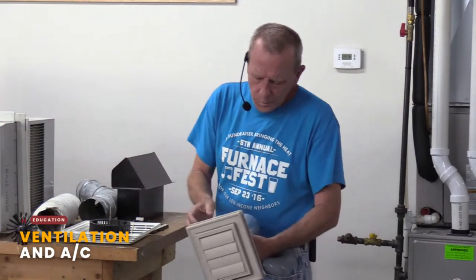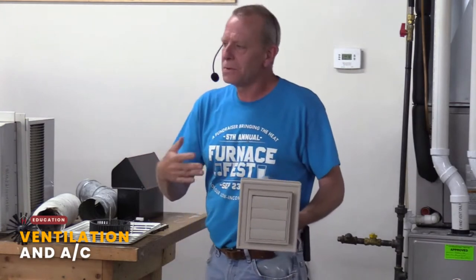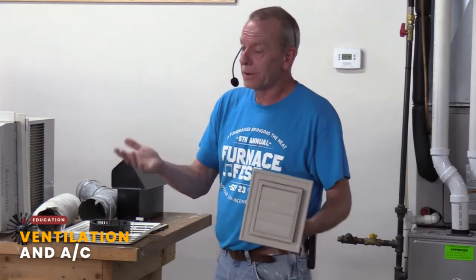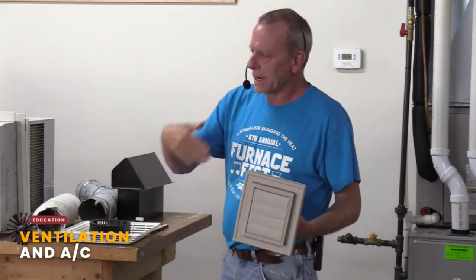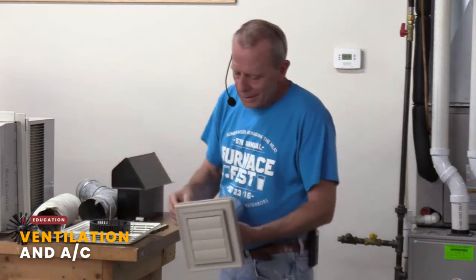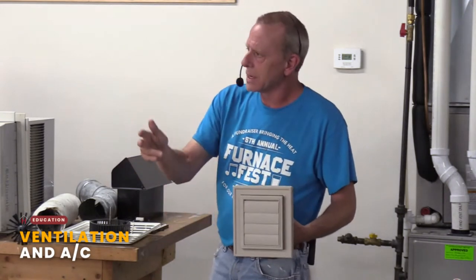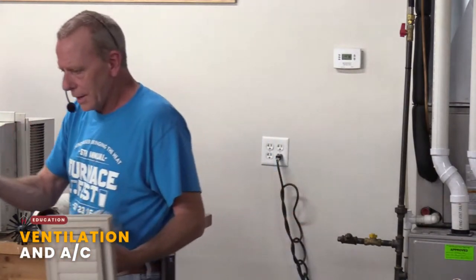If it is not exhausting to the outside, it's something you may want to address when you've got a second, or maybe when you're getting your roof done. That's a good time to say, I want to run this bath fan out, because it causes major damage to roof decks and all sorts of things, and I can't get into all that, but it's not good. So having that bath fan actually exhaust to the outside is a good thing.